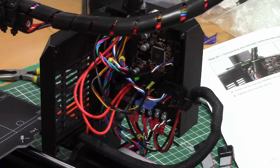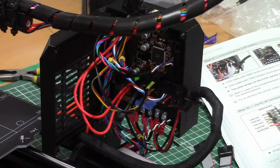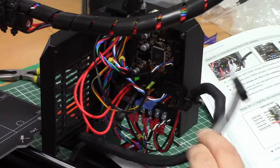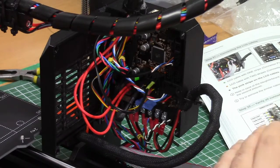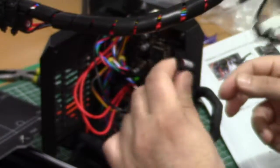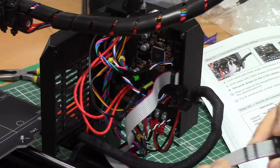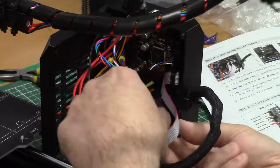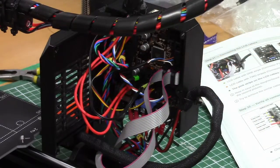Okay, I think we're almost finished. Then, finally, the LCD cables. Connector 1, that's the one with the one stripe. That one goes in the right connector. Yep. Like that. And then the one with the 2 stripes goes in the left connector. The pink stripe on the cables should be facing upwards, check. Perfect.